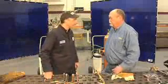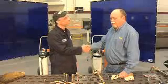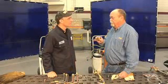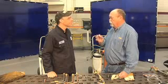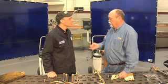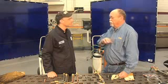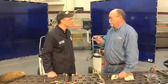Well, Tim, this has been great. Thank you very much. You're welcome. Keep in mind, I can do anything with alternate fuel gas. The misconception is that the fuel gas does the work — it's the cutting action that does the work. With the proper equipment, the proper gas, and the recommended procedure for that particular process, I can do anything with alternate fuel gas that I can with acetylene, with the exception of welding.